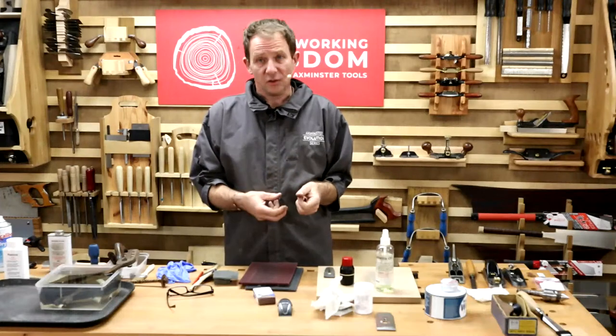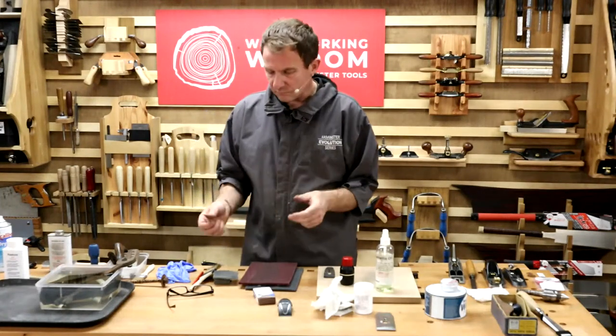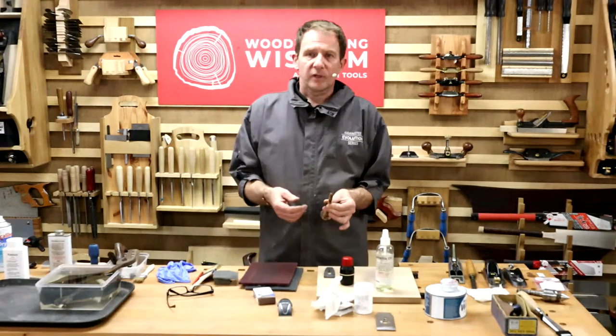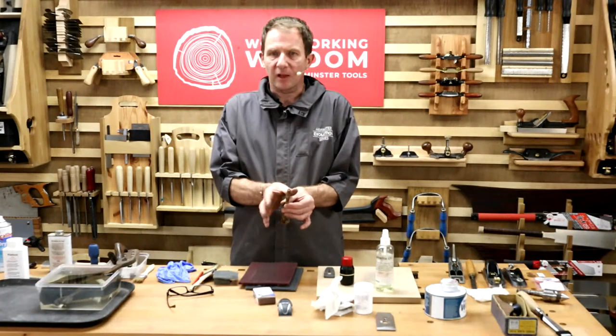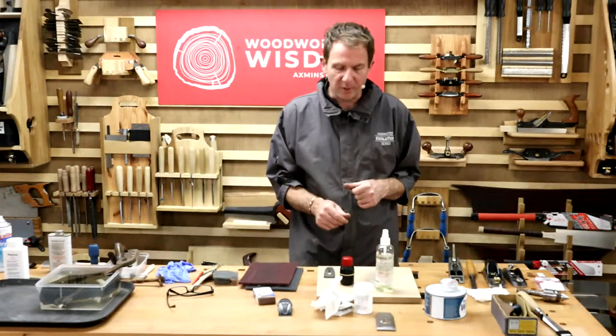If it got to that state and you're getting that deep pitted rust, think carefully about what you're doing, because actually the rust weakens steel. We all know things like concrete cancer, where the steel bar is rusting inside and it expands. It's amazing how much this can expand once it starts to rust. So think about that structural thing, quite an important part.